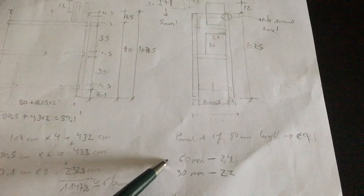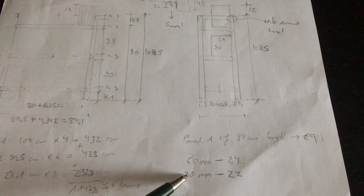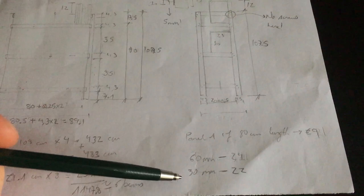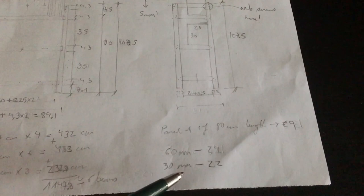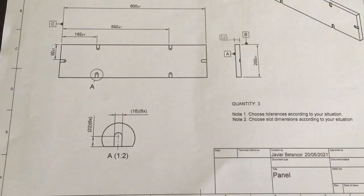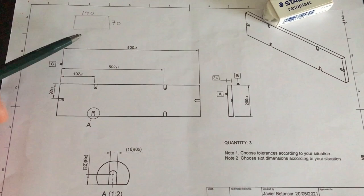For the structure itself I will need 60 millimeter screws, and for the 90-degree angle brackets and the top contact surface I need 30 millimeter length screws — a total of around 46 screws. My idea today is to start with the panels. The wood is much better and I'm looking forward to it. Downstairs I have a coffee table panel — it's not in very good condition, so I'll need paint stripper and sanding.